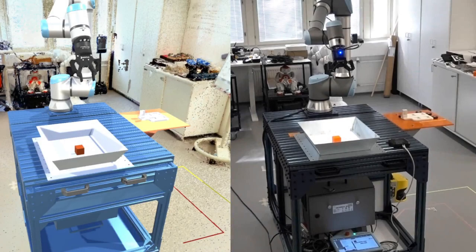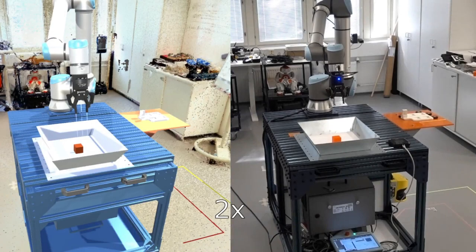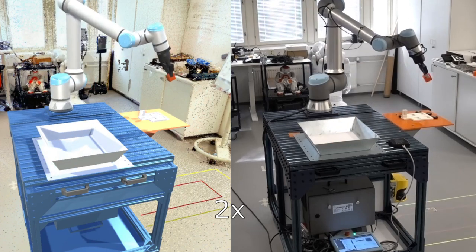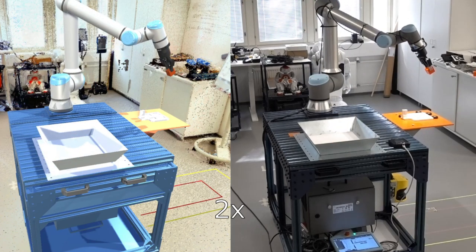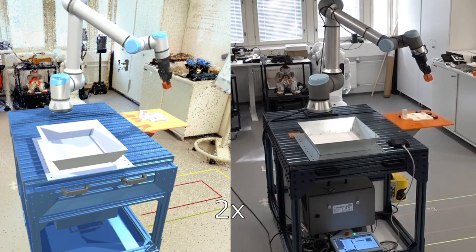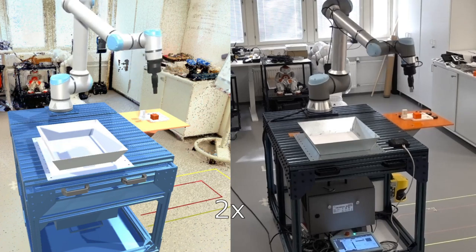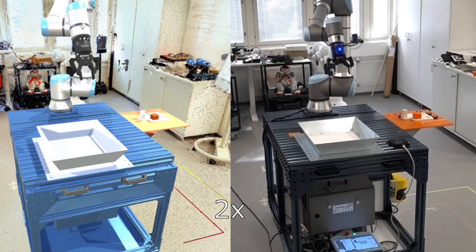The workspace contains a vat and cubes, which the cobot detects with a wrist camera and picks accordingly. Cubes are placed on a jig plate after cobot has verified a free slot on the plate with the wrist camera. Once there are no cubes left, cobot picks the jig plate and pours the cubes back to the vat.